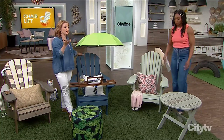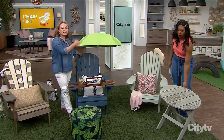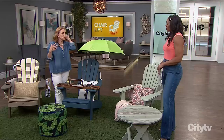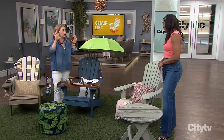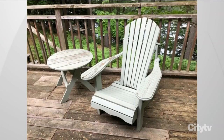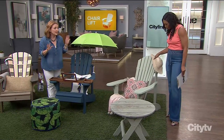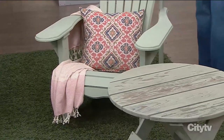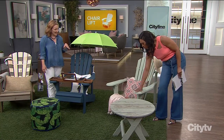This is an older one — 10 years old. A friend donated it for this project. The chair looks good as new now, but the table shows what it looked like before. This is a 10-year-old set that's already been restained probably four or five years ago. It's maintenance for sure — they keep theirs in a shed over the winter, but they can handle being outside with a little more maintenance. If you look at the before, you can see the whole thing in its wabi-sabi glory, and the close-up of what the arms looked like. We wanted to refinish it for the new season, so we used the same color they had — Ferndale green, also a solid stain. For this one, we had to sand it really well — sand off any loose bits, make any repairs, use exterior wood filler to fill any holes. Then cover it. It's a nice vintage minty green — cool and calm.